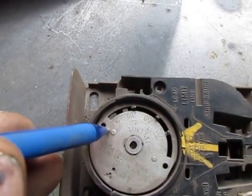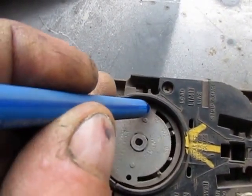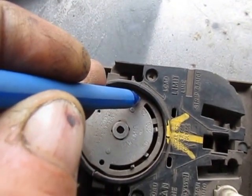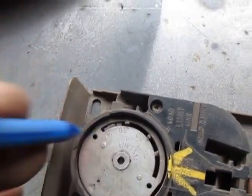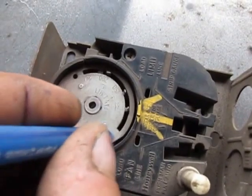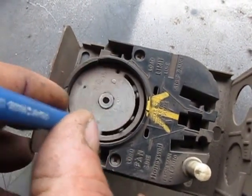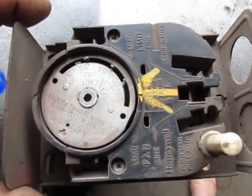As long as it needs to run, that's fine. If for some reason the fan doesn't start, this thing comes up here and the third adjuster goes past the calibration line — that shuts the burner power off to prevent an overheat condition, to prevent a fire. That's all the power to the burner off on most waste oil furnaces.